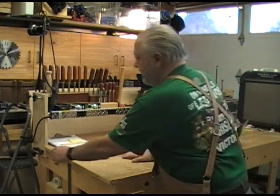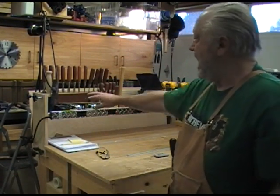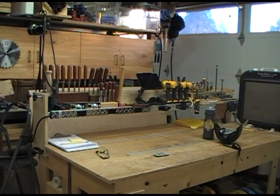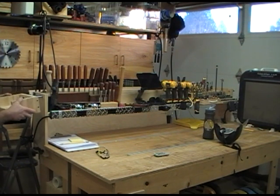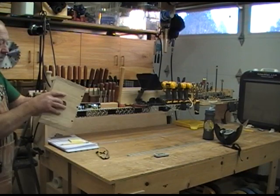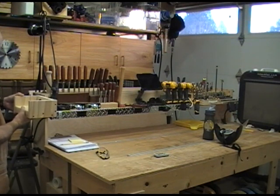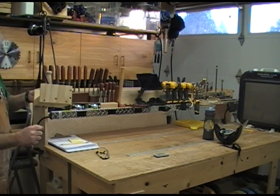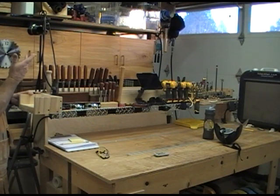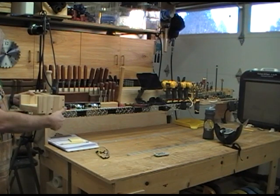But anyway, this shelf here just comes off real easy, with two handles on both sides that you unscrew. I have these two up here because I made these so they go up on top, and they go like this. They're very strong, and they sit in these. And I have those third hand devices, so when this sits out, a third hand device will lift this up if I want it up and out of the way. Maybe I've got something taller that I've got to glue up, and I want to get the clamps over, and I don't have enough height here.